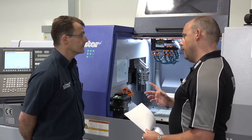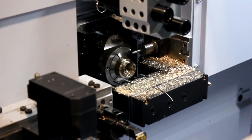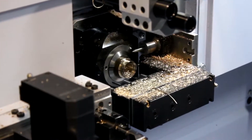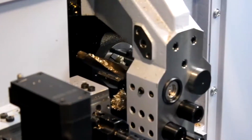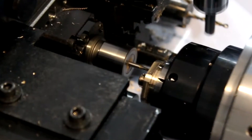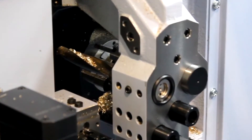I should mention that this is a 32mm sliding head lathe, 32mm bar. You can go bigger than that — we've got a kit that we often sell that takes it up to 35mm. The idea with the sliding head lathe is for production, to make those components faster. A lot of that comes down to how the tools are laid out, the configuration of those tools.